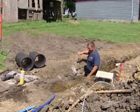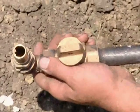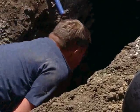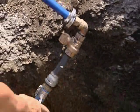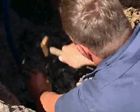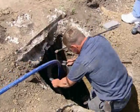Make sure to dig below frost line to ensure frost-free operation. First, install the underground shut-off kit, making sure the water flow arrow is pointed in the direction of the water flow. Attach the shut-off valve assembly to the water line and place into the trench. Then attach the vertical line to the shut-off assembly. Secure the bent rods over the shut-off assembly to prevent twisting when turning the water on and off. Next, attach the vertical rod to the shut-off valve and install the heat tube over the water line.